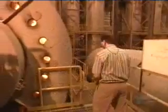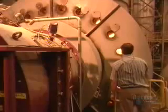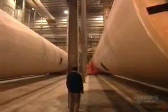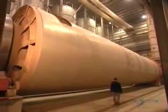To make the humidity level uniform, they put the particles into giant dryers whose combustion chambers are fueled by leftover dust from the chopping mill. After 15 to 25 minutes, the humidity level drops to 1.5%. From here, they'll send the dried out particles to a screening machine, which will separate them by size.